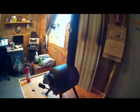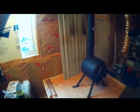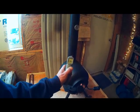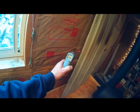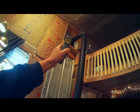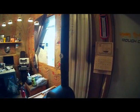It was a piece of Duravent that somebody had thrown out at the scrap yard — so I claimed it. My little makeshift heat shield — gotta have it, because it will get blistering hot. Temperature readings: 480, 620 — almost 200 on another spot. That's what we want to see. My little pass-through box is reading 80 right now, but the stove isn't all the way hot yet — that box usually gets up to about 120. And the wind's howling outside and it's still drawing good. Pretty excited about that.